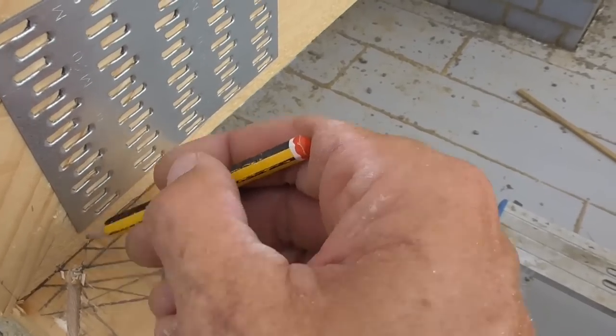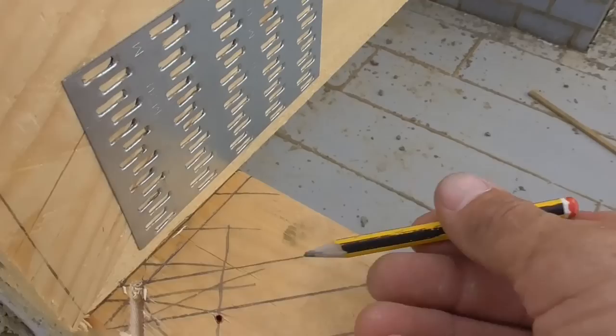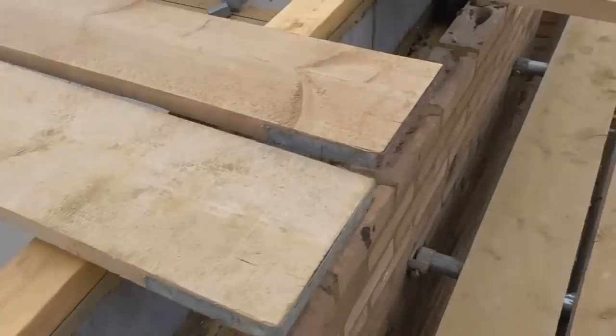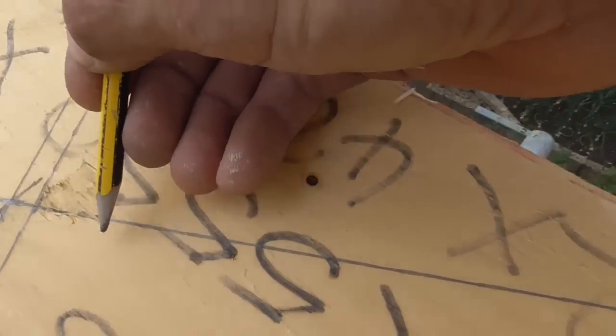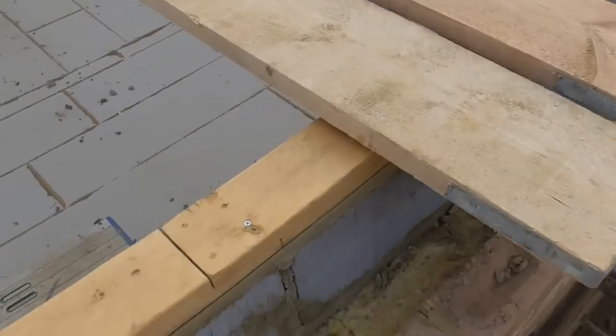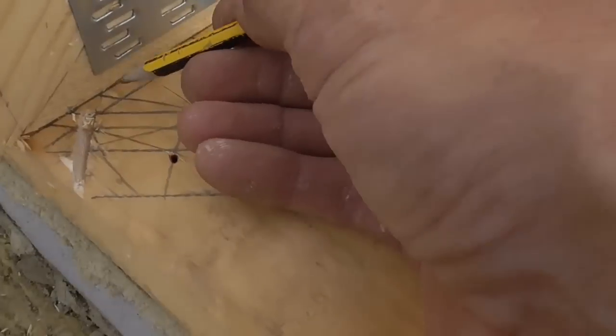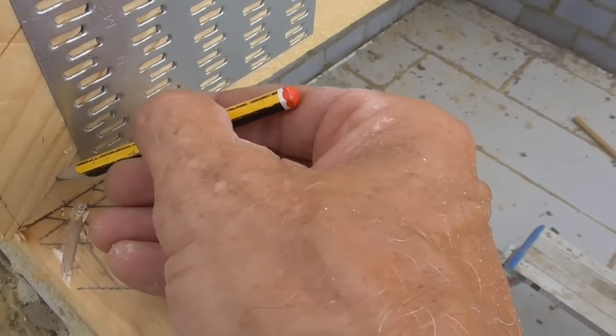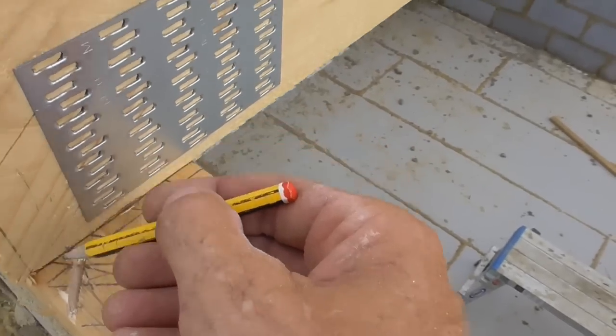So I've cut that, and it's along that line, so it's not a projected line, it's on the seat cut and the 45-degree line, which is what this seat cut is here. I know I'm panning around quickly, sorry. Basically I'm going to let that cut come all the way through, and then that'll meet up there with just a splay cut, you see.